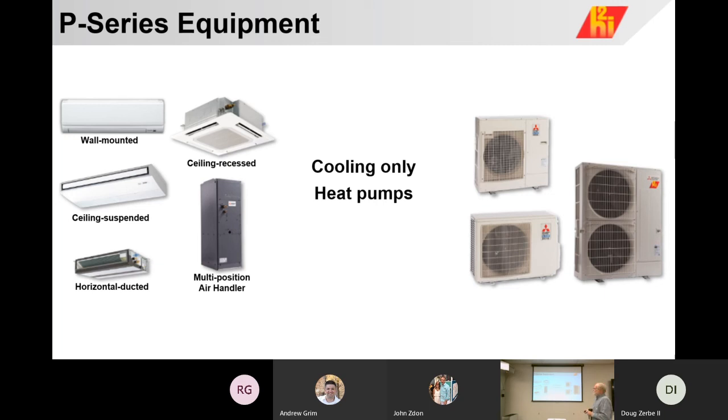The P-Series is pretty much the same as M-Series, but with things missing. The indoor units are similar — we've got cooling-only and heat pump units. What's missing is the multi-zone heat pump — that's not available in the P-Series. However, we do have the ability to 'twin' — two indoor units with one outdoor unit. It's a special application with good application notes covering what's required. For example, a long room where you want to put two ceiling-recessed units to spread out conditioning, tied off one controller.